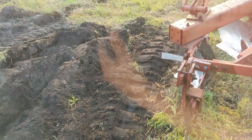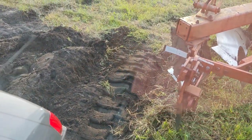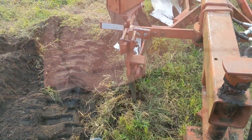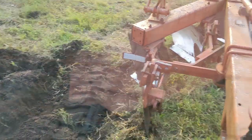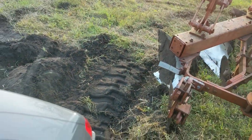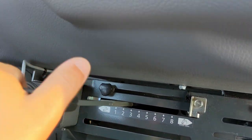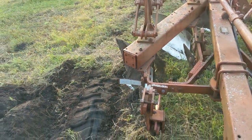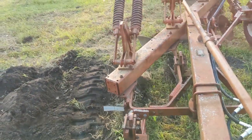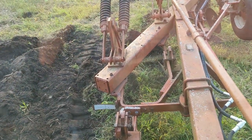If this is the first time you've done this, you start out with both bottoms. When the first bottom is right at the last part of the plow point — especially with the four-bottom — drop her down. I drop it down to about two and three, that's probably good. Then pull it forward a little bit so you can see both of those plow bottoms digging into the dirt.